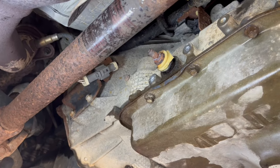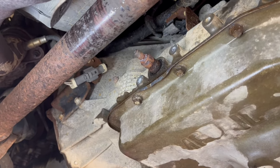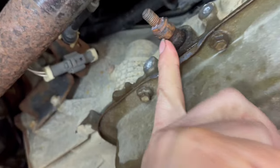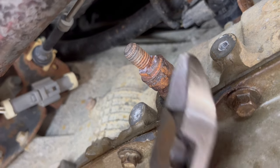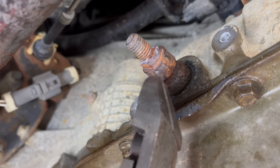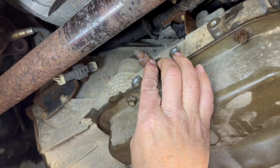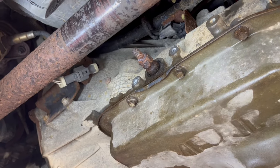I'm glad I'm showing this video on this one, because the last thing I want is for you to watch one of those videos where guys just pull this thing off and it's simple and easy. You see how rusted that shaft is? See that big chunk of metal? Watch when I tap it and it comes off. That's what you've got to get off there. You've got to clean all the way down to the bare metal — there are two grooves, one near the top and one below it, and you've got to clean those grooves out really well.